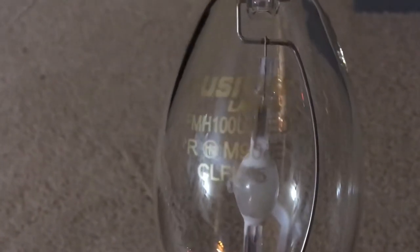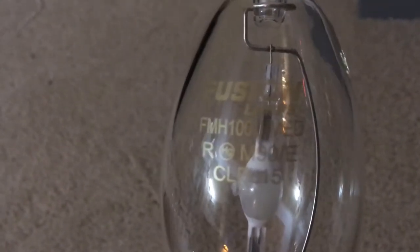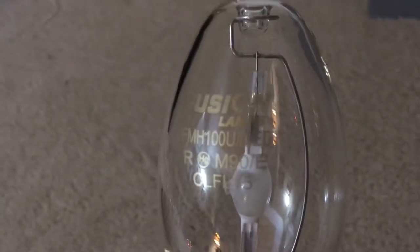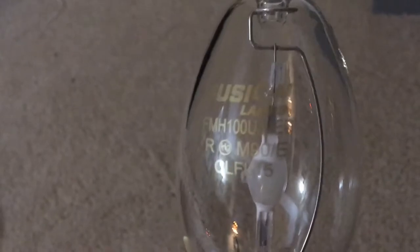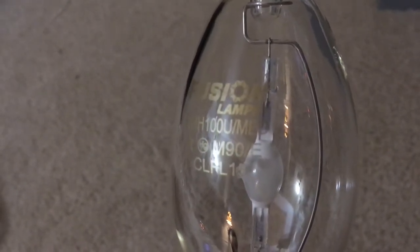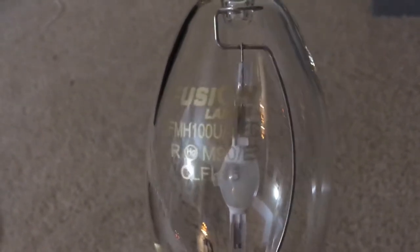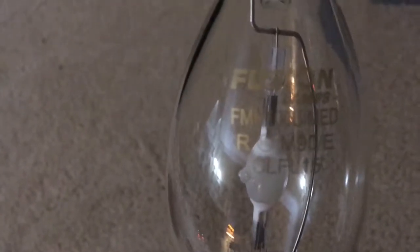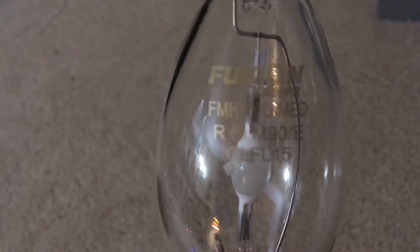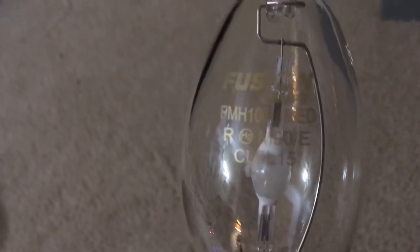We have our 100/100U. 100 is obviously the wattage, and the letter U means universal burn position of the arc tube burning position type. But I'll also be putting the burning position in the description below of this video as well, so you'll see that too. And the MED meaning medium base. And the letter R means that this bulb will emit a lot of ultraviolet radiation if punctured, cracked, or shattered or broken, anything like that. This bulb will not self-extinguish on its own.